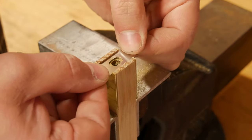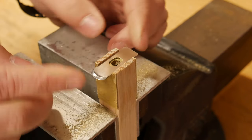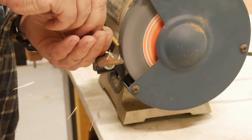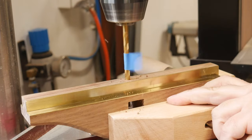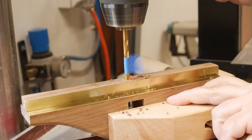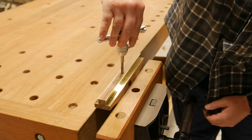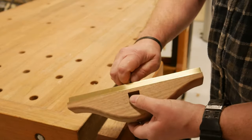It was only at this stage the brain kicked in and I thought of using the panel gauge as a beam compass as well. After the head was cut off a bolt, a point ground up, and another hole with a steel thread inserted, I could insert this pin when needed to lay out a circle or an arc.